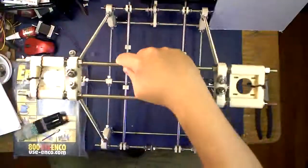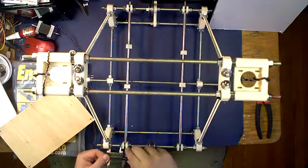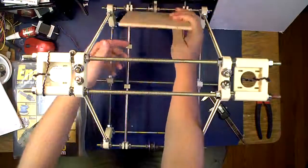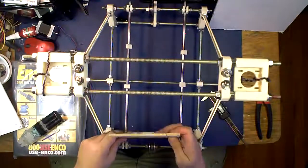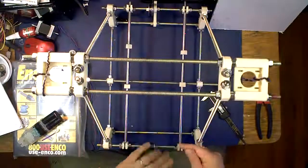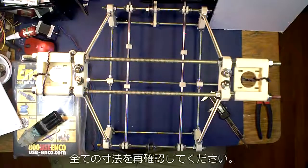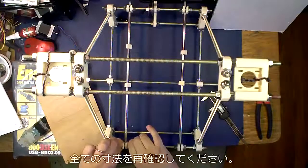Don't be afraid to measure 15,000 times. We know this one is 104 millimeters, so now we space this side out until it is just as snug as the other side. Once you've done that, you should now have two parallel smooth rods.